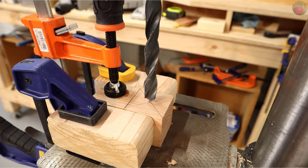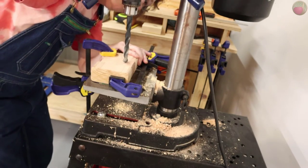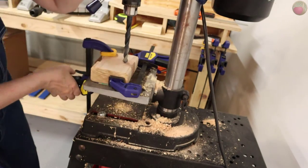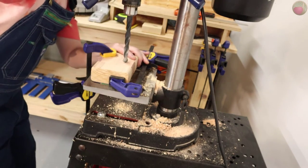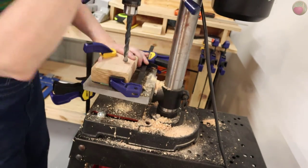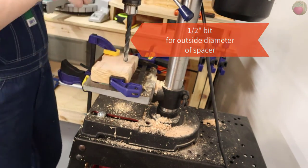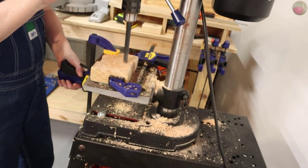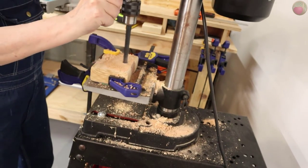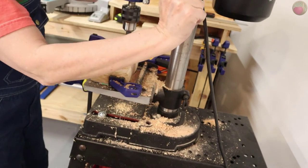You can use whatever clamping methods work best for you. Here's my alternative setup from the prototype — I simply clamped all three pieces together from the side, then clamped the whole thing to the drill press. Look at your lineup from all angles. It's not likely that your bit will deflect, but you want to be as accurate as possible. If you're cutting through oak, expect to see and smell a bit of smoke — that's some hard wood, unlike the pine I was using here.